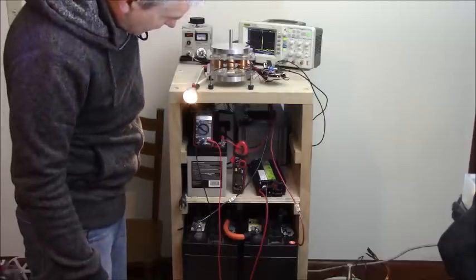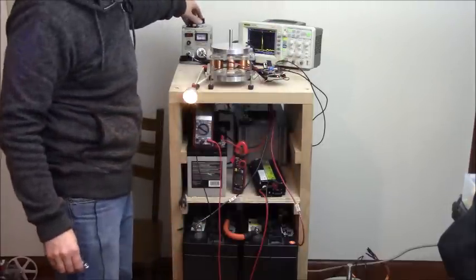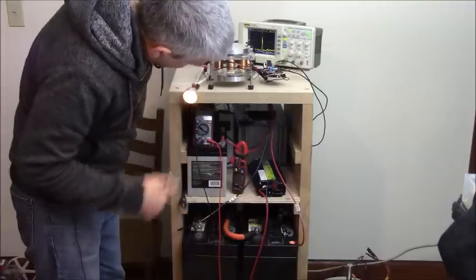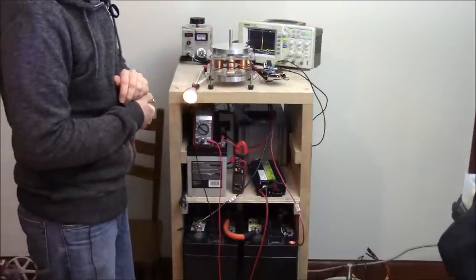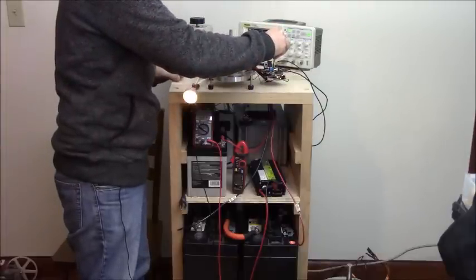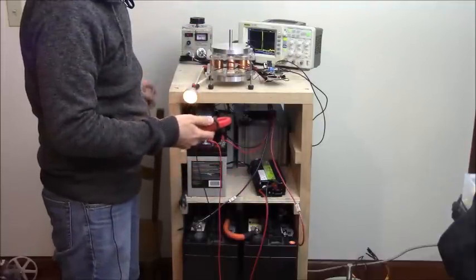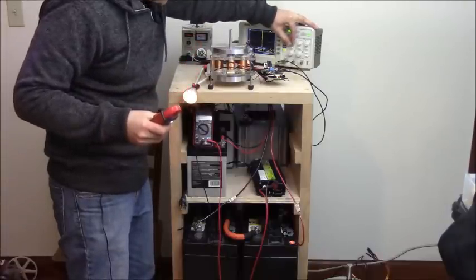And we're only running, well, oh, I know what. So we're only at 5.9 volts, and it's climbing on the batteries below. I can't put an inverter on it yet because it's not going to do anything at that low voltage. So we can adjust the on time. So now I've turned it up. I'm way higher than the safe operating area of the MOSFET.